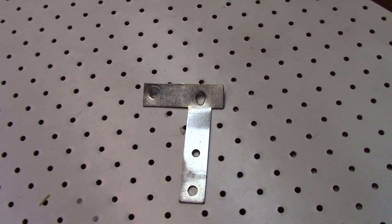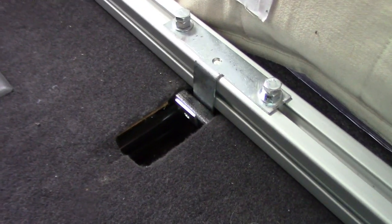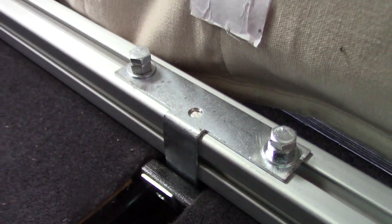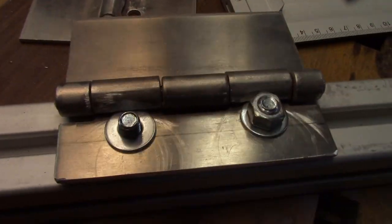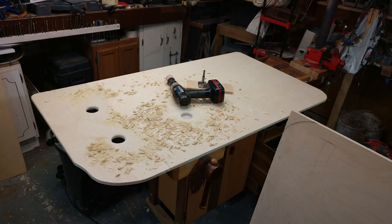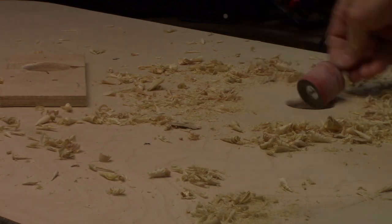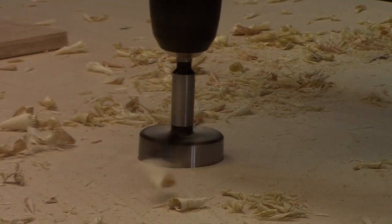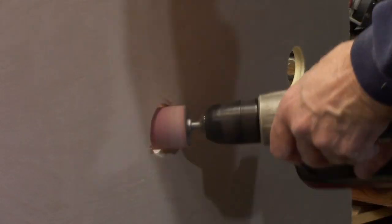My first attempt at a T-bracket was a miserable failure. Here's my second attempt, and this is what worked — I made a couple of bends and it attaches to the seat bracket in the floor. I put a little piece of rubber underneath so they don't rattle, and they're dead silent, which is great, and super strong — they hold the whole thing down. These are aluminum hinges showing how the front and back platforms will hinge. The back platform is narrower than the front. I used a Forstner bit to drill air circulation holes, put a piece of wood underneath as a backer, and then sanded them smooth with a drum sanding attachment.